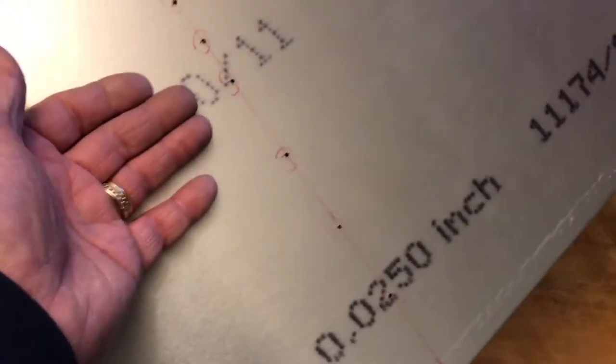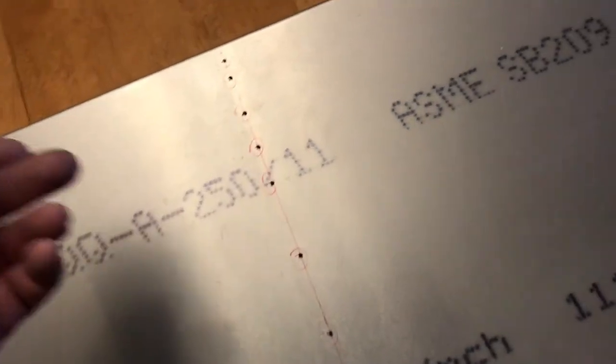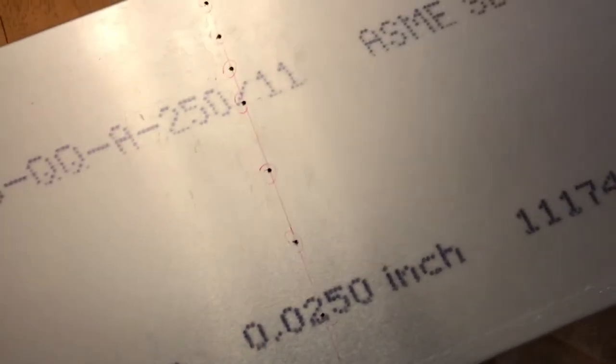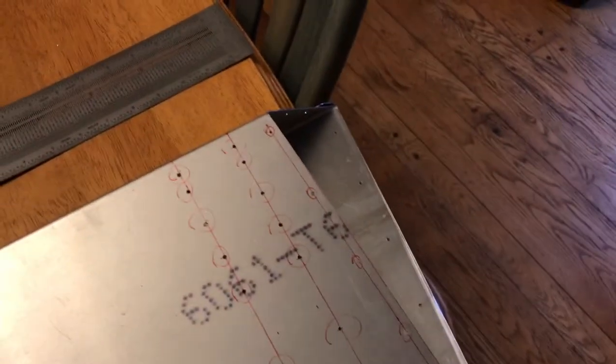Then flip it over and do the other side of the rib, and do the end as well. When it comes to doing the rib in the center further in the skin, I'd use either a yardstick or a broom handle to push against the rib and tap it lightly to get the holes to line up. Obviously the ones in the center have to be done before you do both ends — don't make that mistake. You can always remove the clecos and pull the rib out, so do the center one and it doesn't really matter.